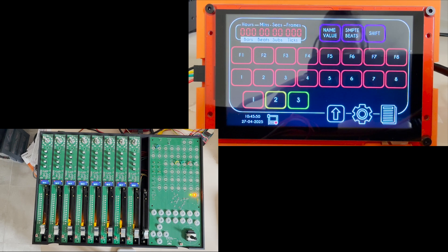Let's go and start. I'm going to restart my console — there you go. What you see at the bottom is the connectivity indicator, because now my board is connected through Ethernet. As you can see, a message has appeared saying that there is a firmware update to be done. What's happened is that the system has checked my server, where I'm exposing some REST APIs developed in C#, double-checking the versioning and discovering that there is a difference between the version installed inside the main board and the one available online.